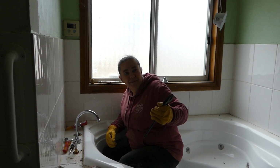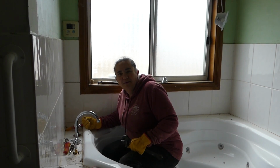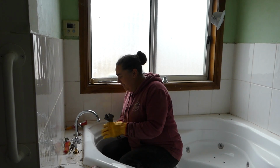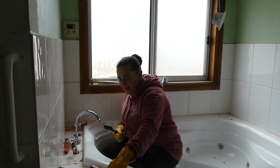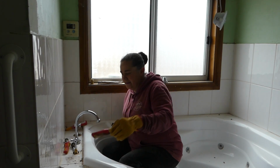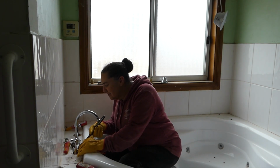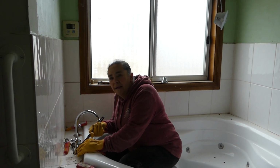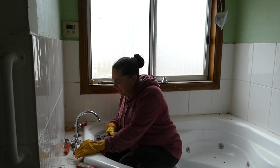You didn't want to do it, so now I'm doing it. So this washer on the cold water tap was completely broken, and so the cold was getting into the hot. I've got in here, I've changed the washers, I've undone this bit here, and I put this liquid sealant on it so that it'll be completely sealed. Now I'm just tightening this bit up to make sure it's nice and tight so that nothing leaks, and then we'll have hot water again, because the hot water was not really hot.